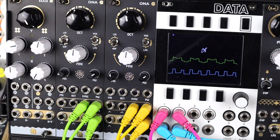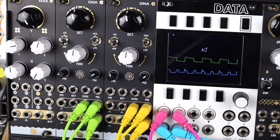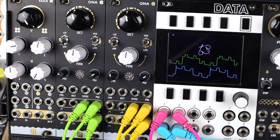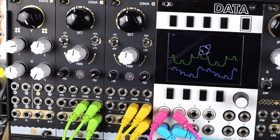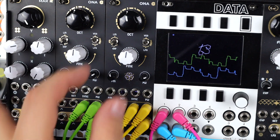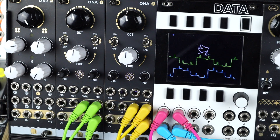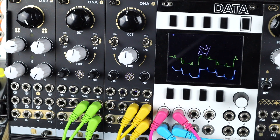Here's a lovely big rich thick patch using the minus-2-octave sub (divide by four), the minus-1-octave sub (divide by two), and the normal bass-rate square wave. You could take this stereo mix into filtering, effects, and VCAs — treating left and right signals differently. I simply wanted to mix three octaves of square waves together. Knocking the tuning out slightly and using some thinner pulses — it's just a big, rich sound.